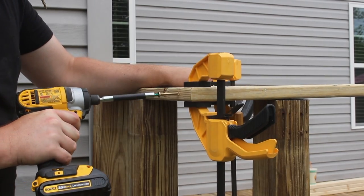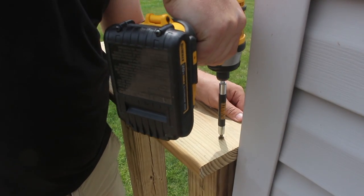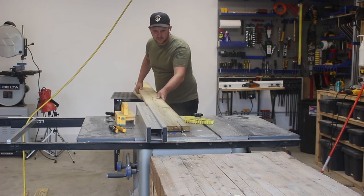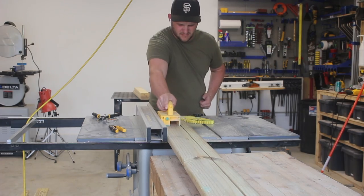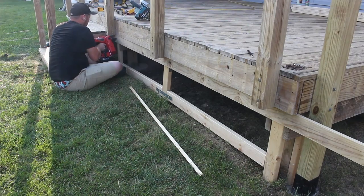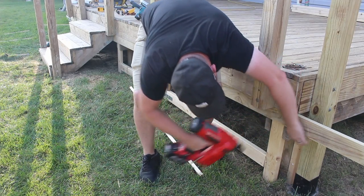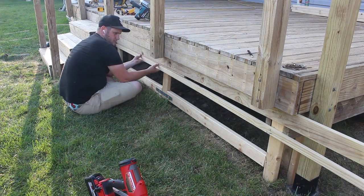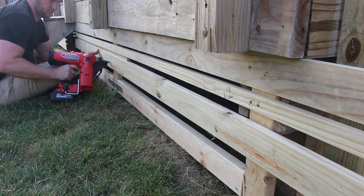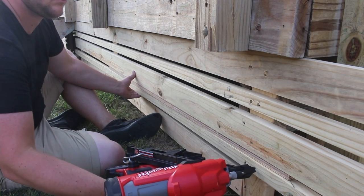As with most deck applications, I'm just using deck screws to hold everything in place. It's pulling these miters tight and keeping the railing nice and strong. For the bottom skirt, I'm going with a really awesome modern horizontal pattern. I broke down these boards on the table saw and then I'm just nailing them in place with my framing nailer — quick and easy. The pattern is super simple: alternating between 4-inch boards and 2-inch boards with a scrap piece of plywood in between, which looks really nice and gives it that awesome modern feel.